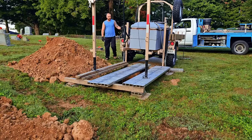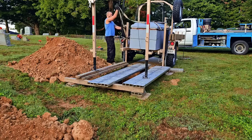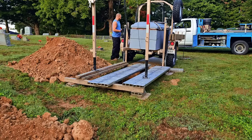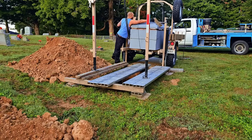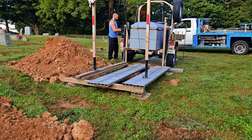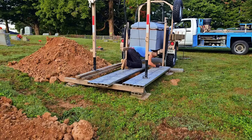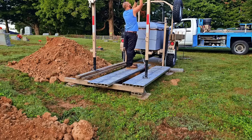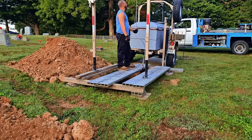We then use a jack and blocks to remove the hilljoy out the side, and then we can swing the vault from there. Since this Johnny Handler has 3 hydraulic leveling points, we are able to place those down and raise the entire buggy up into the air and make sure it's level before pushing the vault out over the platform. In difficult positions, we can use the winch on the top of the boom that pulls the burial vault out over the grave using a cable system. This piece of equipment really comes in handy on steep hillsides. Without the hydraulic lifts, the vault has the tendency to swing and move up against the side of the buggy, which can damage the lid or just scratch the paint.